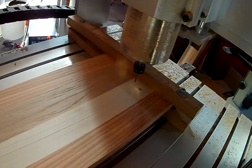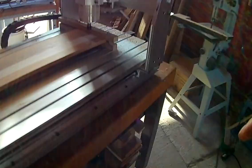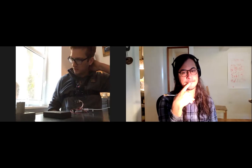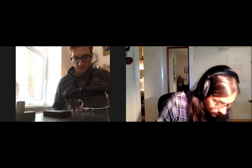This is the spindle. And they all connect down to here, which is the driver for it. And the orchestra is these square wave oscillators. Well, they're not square waves, they're actually just pulse waves. They have a certain length, tuned to the motor, with certain accelerations. It makes these waves to move the CNC machine very precise distances, and it counts all the pulses it's doing, very precisely generating signals for the CNC machine to move around.